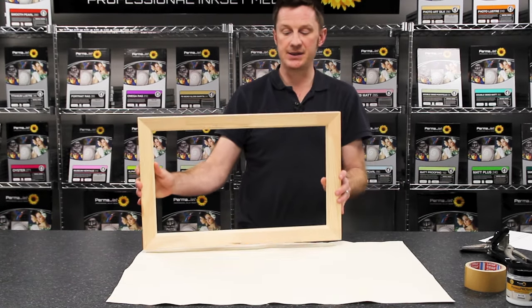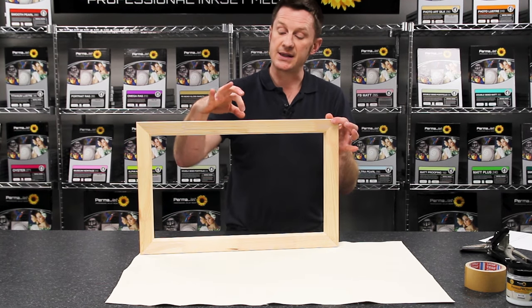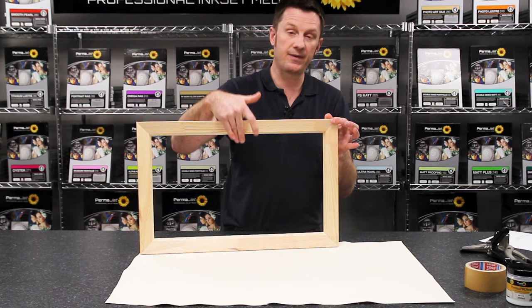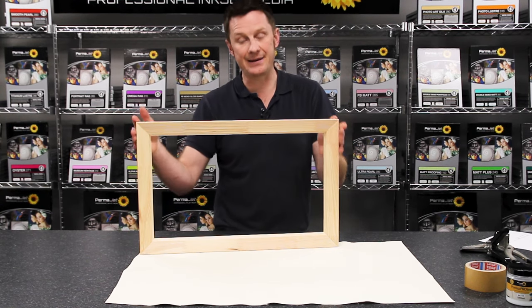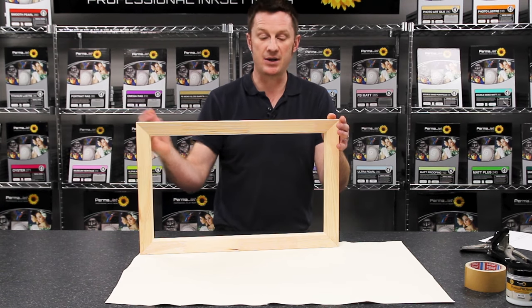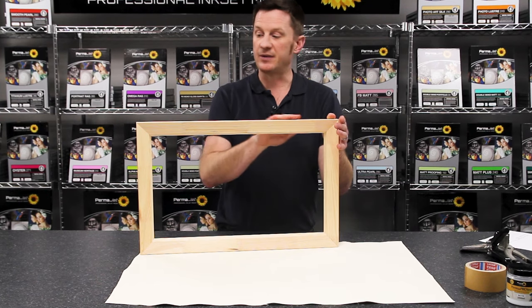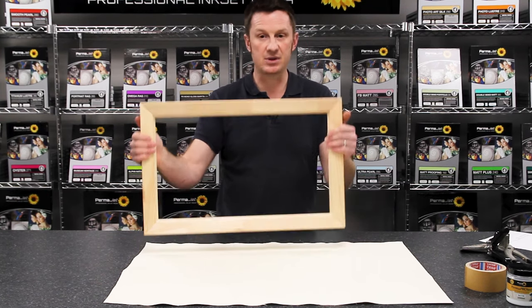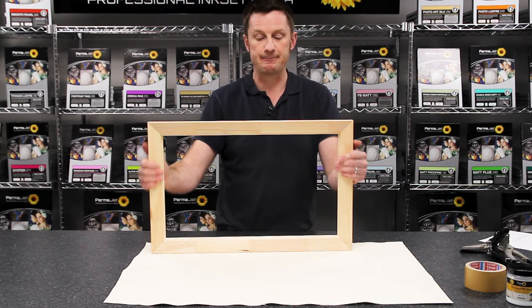So in this case, I'm using a made stretcher frame. It's a 30 mil deep profiled stretcher bar. Being a picture framer, I've cut this from length. Some people may prefer to use pre-sized bars using corner wedges or sometimes other clever fittings. But for me, I tend to make my frames to any particular size. Just that's how we work being a picture framer.